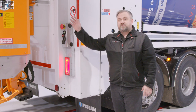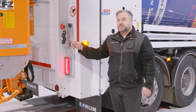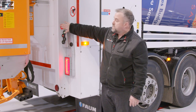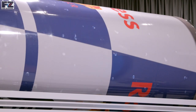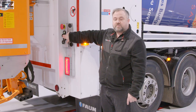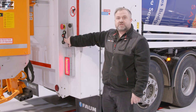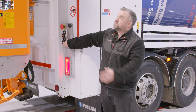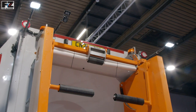At the back of the Rotor Press we have two external control panels, one fitted either side at the back of the tailgate. At the top of these control panels we have the emergency stop button. Below this we have the green button which starts the compaction mechanism and starts the drum turning, the red button which stops the drum turning, the bell which signals the driver in the cab, and the work light switch which turns the external rear working lights on and off.